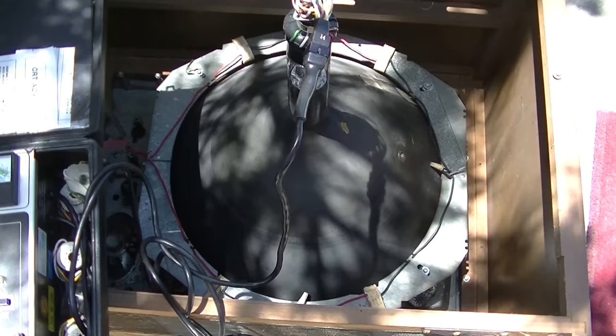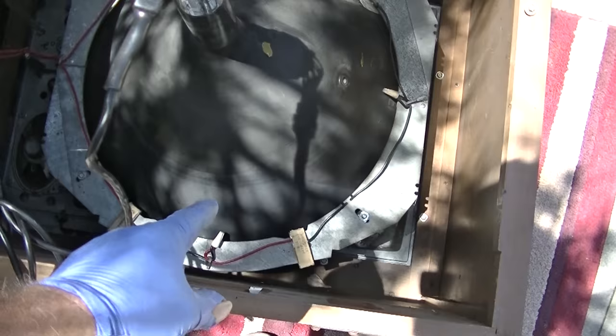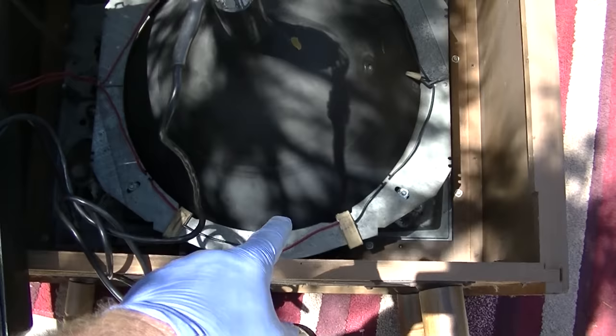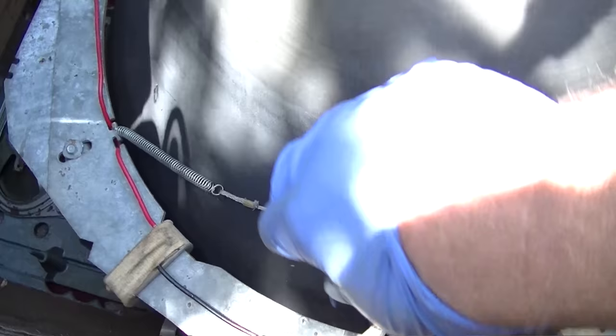The Sylvania CRT is in, as well as the speaker. While I hunt around for a spring wire ground assembly for the DAG, we're gonna compare this to the one we took out, so I'm gonna let it warm up for a while. I'm usually pretty good about keeping the CRT grounding springs and stuff from sets I EOL. I got our spring here, and this is not quite ideal, but remember, this is just a resurrection. It should go from over here, and then the spring should be more in the middle.